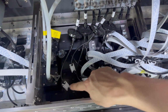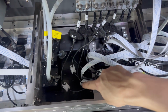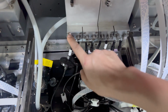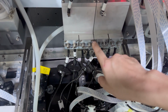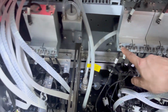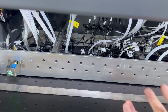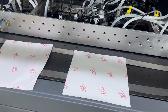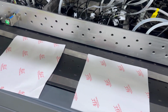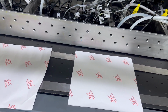We need to double check to be sure all the switches are open, and all the switches at the sub ink tank are open. And still we need to do a flush to flush the ink out a little bit. Then we check again. Then we start the flushing job with the control software to make the missing nozzles come out.